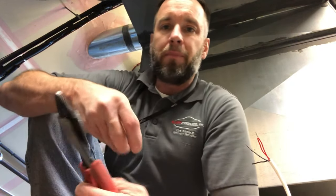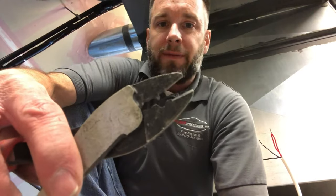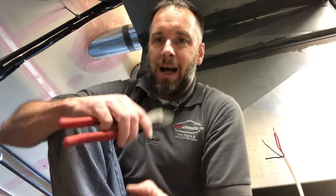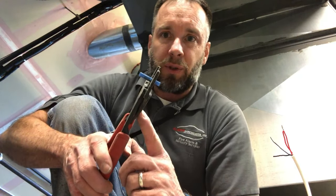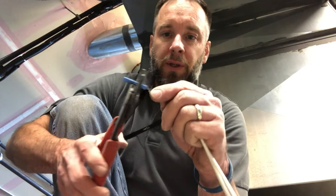The biggest thing for crimping is you need the proper tool — a crimp tool. You can see it has two different crimp points. You have to have the right tool; without it you're not going to get a good crimp. A lot of people try to use pliers and it ends up being a loose connection that works its way out. I'm someone who tries to find a shortcut in everything, but with a crimp you just can't do it. You've got to spend the extra money on a crimp tool — for anything around the house, it's an invaluable tool.